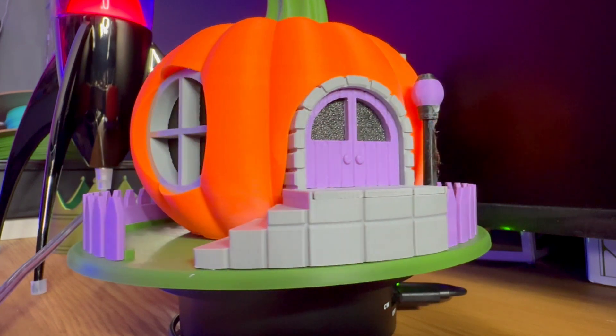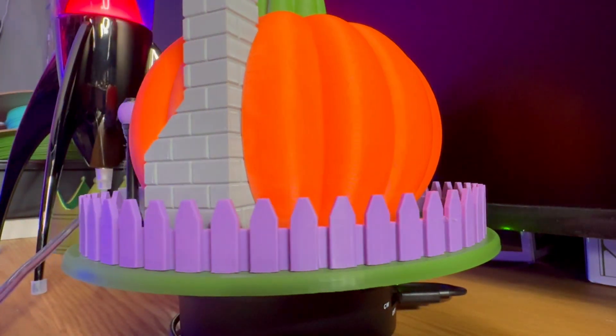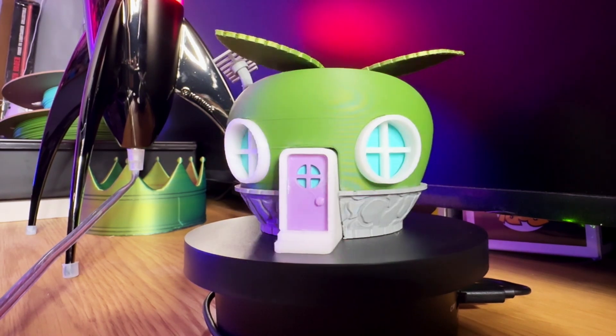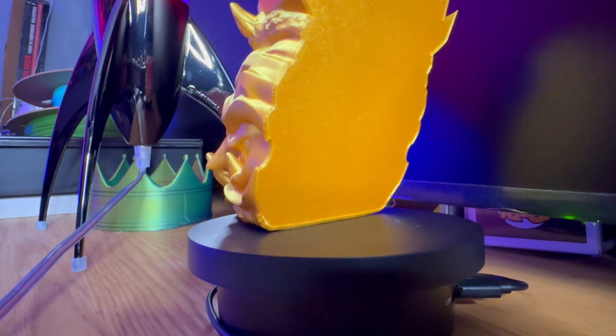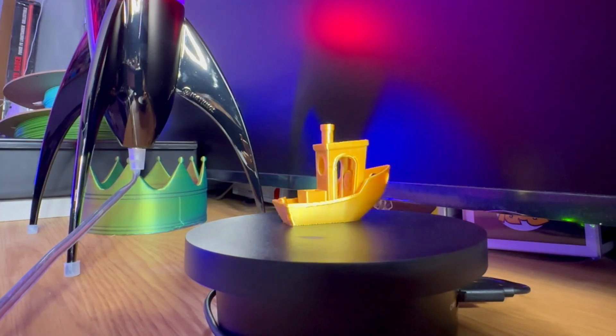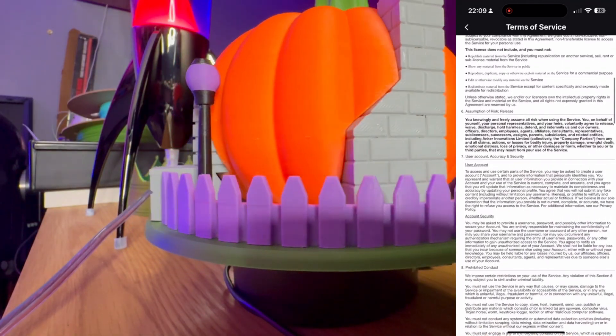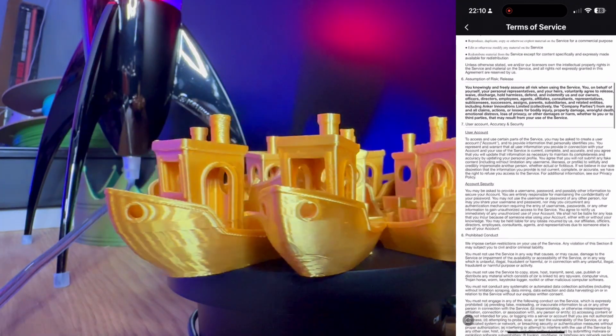When we got into the initial stages of 'Boatgate' it did concern me, but then we moved on and printed the PA1 Pumpkin House, then another one, and then the Apple House — links in the description. I've been really impressed with the overall print quality. Everything about this machine has been pretty good, other than the top speed of 500mm/s, which I think is very much a marketing strategy. The 250mm/s is pretty much the sweet spot. One note: Grant over at 3D Musketeers has been looking into some questionable elements of the sign-up terms, so I'll pop his link in the description if that concerns you.